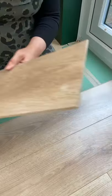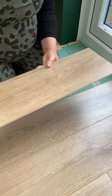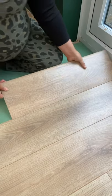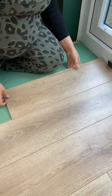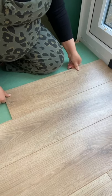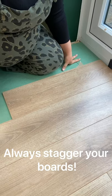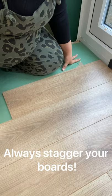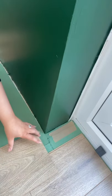The piece that you've just cut will also have a flat edged side. This is the piece you would use on your next row, with your spacer in between the wall and your laminate. That's ready for the next row to do exactly the same thing until you're finished.